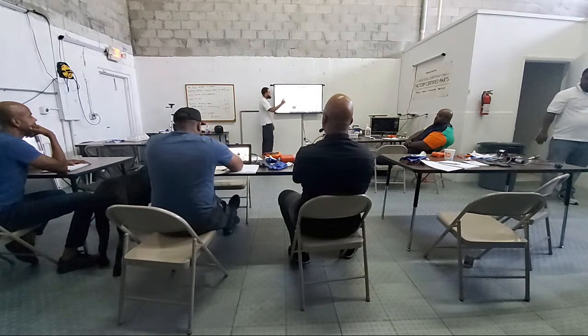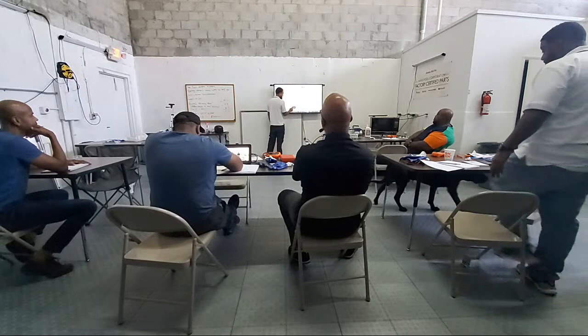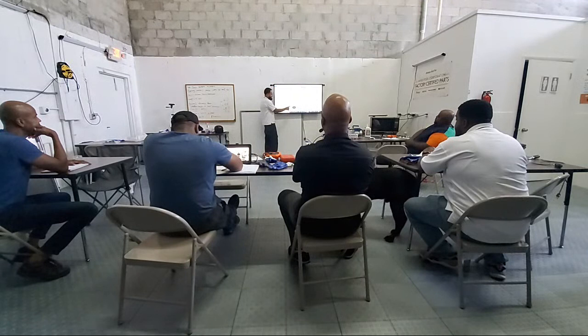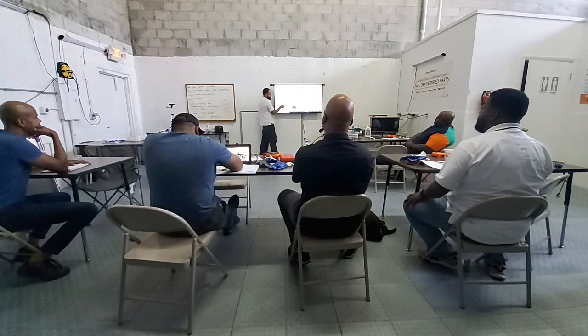Remember, we got another valve. We got an access valve here, right? Here's the answer to your question. Here's our third valve, right here, which you said is your process. The one where we took the filter dryer out. We literally removed it. Now we're going to hook up our gauges and our nitrogen right here, to our tank. We're going to put in 120 and flush nitrogen.